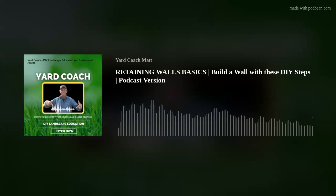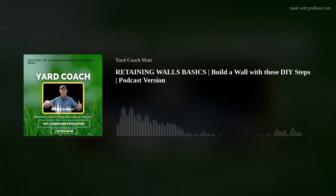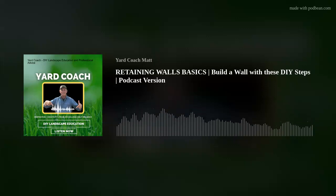And generally in residential applications, most of the time you start stepping off into pulling permits anything over the 4-foot mark. I'm sure there's some places out there where it's 3 feet. I'm just telling you what I used to have was 4 feet. So now that you have your key pour done, your foundation done, now you're going to bring up your plywood forms.